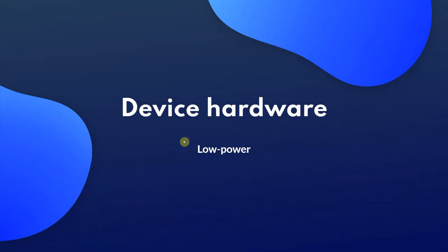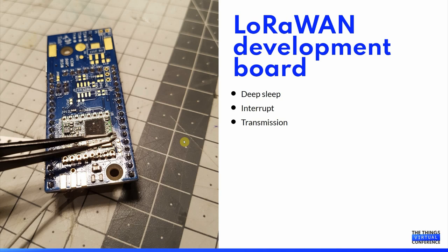Next, we will look at some very important hardware considerations. To be able to achieve long battery life, the device will have to be in deep sleep mode for as much as possible. Therefore, I had to choose a LoRaWAN development board that had the lowest possible current consumption during deep sleep. Also, it would have to have the capability of defining the type of interrupt that would wake it from deep sleep when needed. Finally, the current consumption during transmission would have to be at the lowest possible level.